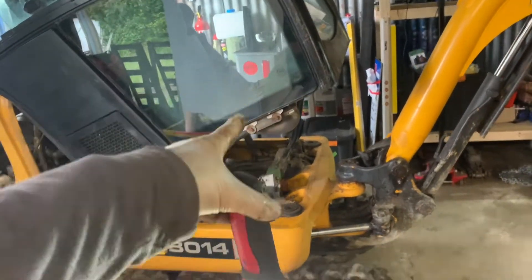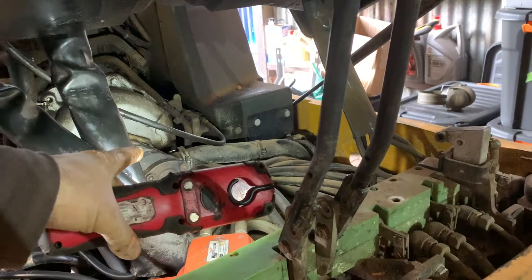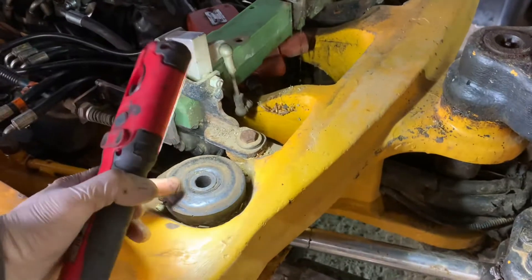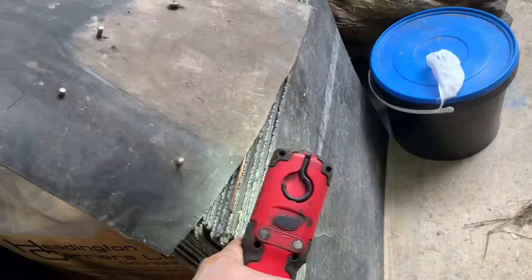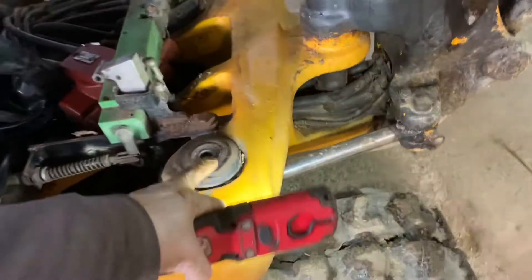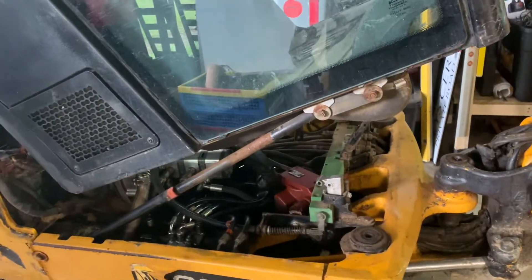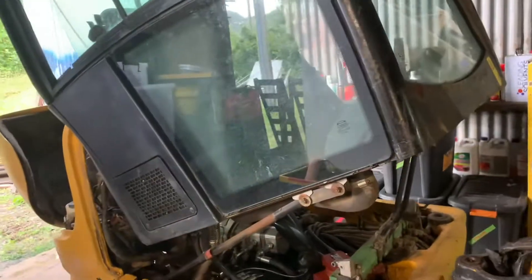I can't see how this is going to go down, so my suggestion is either put something on top of the pump — but that would just get worn through by rubbing against the cab — or replace the mounts, or put a shim on here for now. If I can lift up the front by maybe two millimetres... I've got some old carpet here, some office carpet with rubber backing. I figured I'd cut a washer shape out of that and put it on there. That should last, and I'll know pretty quickly because it's a deafening knocking noise coming up through the cab — you're in a little echo chamber, it's horrendous.